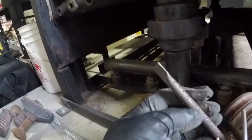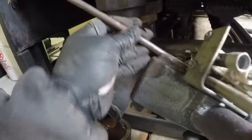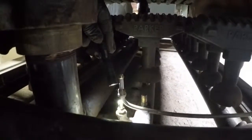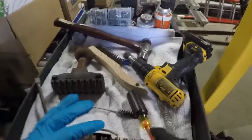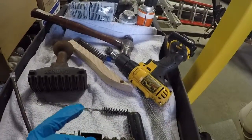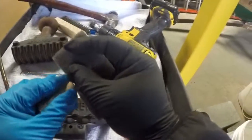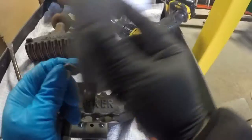See the little holes there — I want to make sure those holes are clear, just like any other crossover. Right down the center there. Here we have the little orifice for it — we got our ignition. This is double-aught steel wool, and what that's going to do for us is allow us to clean up our electrode and our flame sensor — the flame rod.